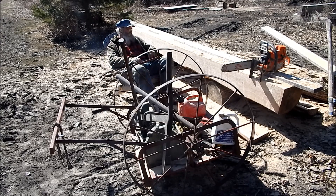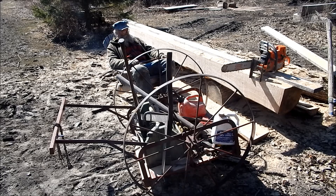I've got two chairs I bought last fall that sit outside, and I'm going to put some of that red ochre on them today. The pine tar makes them weather resistant, and the red ochre blocks the UV. The beam I'm cutting here will actually be pilings going into the ground. I need to coat those with pine tar — start out with pine tar and turpentine, slather it down good, leave them in the sun, hit them with a torch, and bake it in a bit. Then the last coat I'll put pine tar, linseed oil, and turpentine on and bake that in. Particularly on the ends — that's where you really have to do it. I'll probably do one coat first on all the end grain, then come back and do the whole thing.